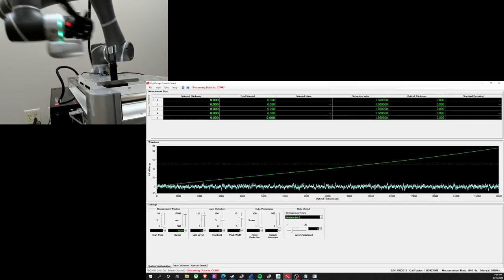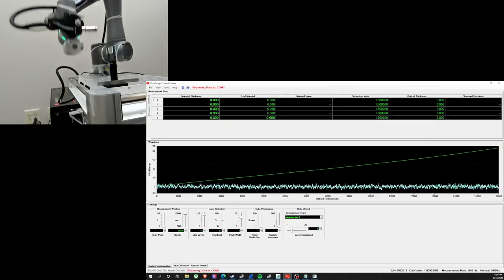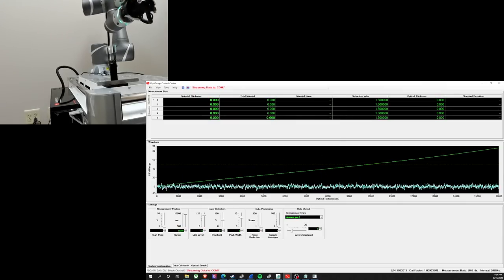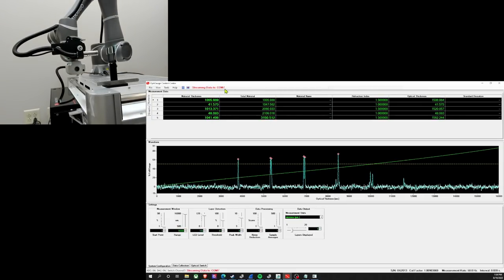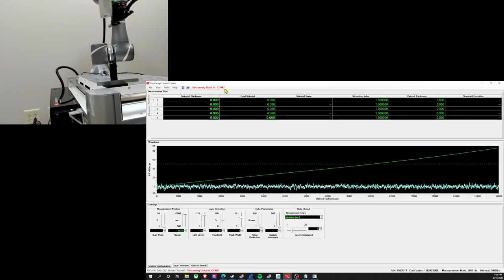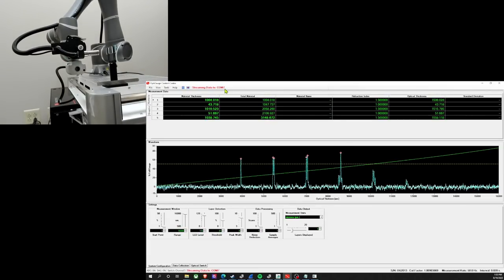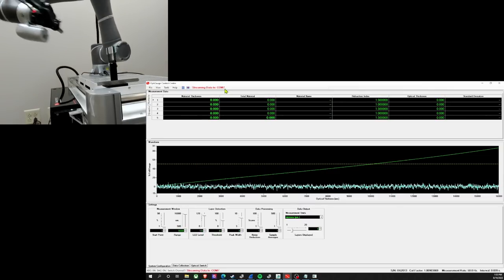And there you go. It's finished the backside, took the picture of the front side. Now it's taking the first six measurements on the front side. And we're streaming this data constantly out to, you can see it's streaming to COM7 there. So we're creating a big long file, which anyone can analyze at a later date, or you can do it live if you stream that data direct into another instrument or program. But the combination of the OptiGauge probe, the camera, and the robot becomes a very useful tool for checking the multiple thickness layers of stacked glass.